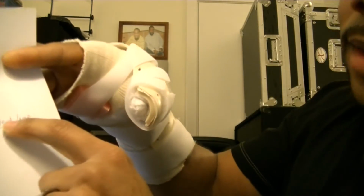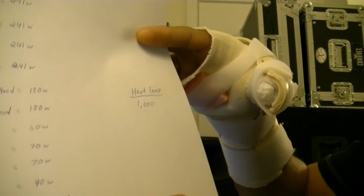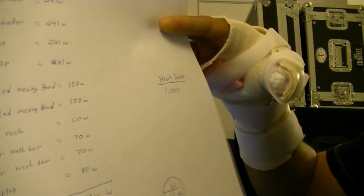You're pulling that, and you've got a caterer or somebody else in the room with a heat lamp that pulls about, let's say, 1,000 watts. You add that 1,000 on here, you're over 2,000 watts already pulling from a circuit, and you're sharing that with them. Suppose they plug something else in, boom, everything shuts off because you're on that same load on that circuit with them. That's why, if the venue offers it, I'm plugging into the 30 or 50 amp circuits separately. You see it on big production events, clean power.